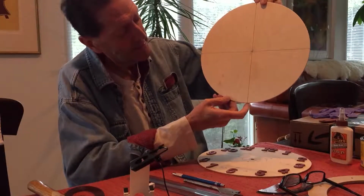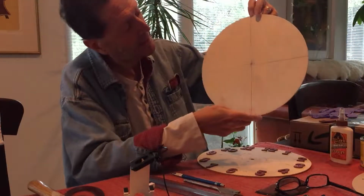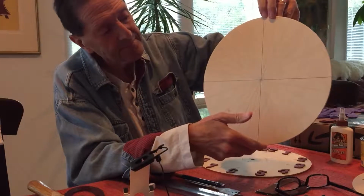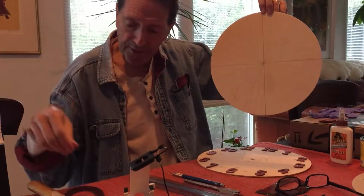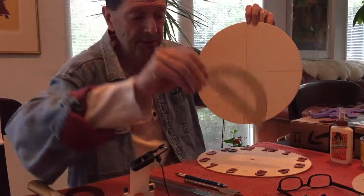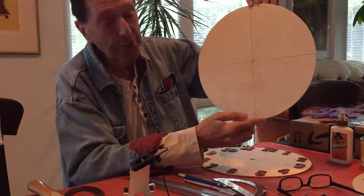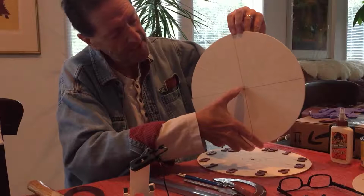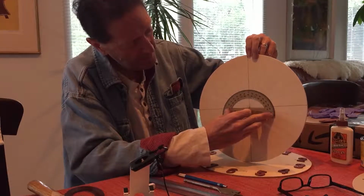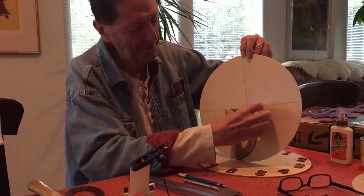I created a meridian. I used my template. My template is pretty accurate and has a true north and south. So I created my meridian lines, which are in black. You can see those. That's the vertical and horizontal. And then from that, I used my protractor right up here. I was able to count 11.6 degrees from the horizontal, and on and on and on until I had 31 lines. Center, 31 degrees out. And we can see if we put that on there, we calibrate extremely precise. Each one is 11.6 degrees, which is perfect.